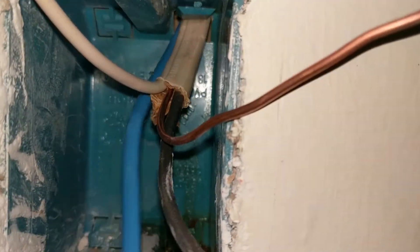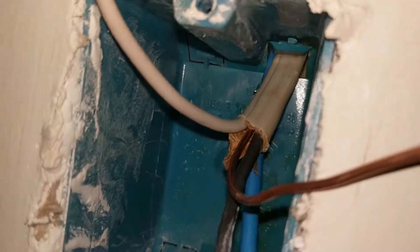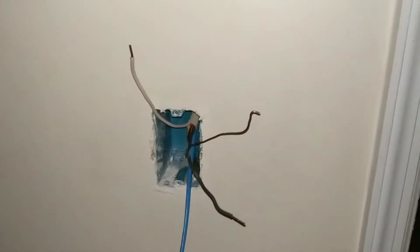I was trying to pull from the attic and it was bound up, so I'm just going to push a good bit into the wall so I have enough slack. When you're in the attic and you can't get it, it's better to come down and do this because if you try to yank on it you're going to end up tearing up the wire. Once you feel like you've got plenty of cable, don't pull too hard — that should be plenty, just touching the floor.